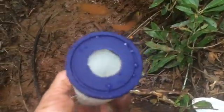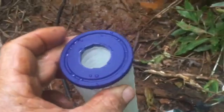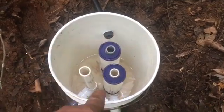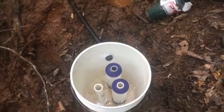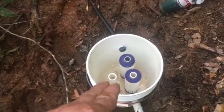Here's my filter setup. They come out with a one-inch, go to one-inch to three-quarter, and then this is just a three-quarter tee and elbow if you want two of them. We drill a set of holes that are above where the filter will sit inside. You do have to take a razor knife and cut a little bit out on the bottom — they used to fit right over three-quarter inch pipe but the metric conversion changed that. These are just plain sediment filters you get at Lowe's, two for about ten bucks. Water comes in from the spring, has to fill up, go through the filters into those holes, and out this pipe to the tank. One pipe is overflow, and I might go ahead and pipe that overflow into the tank as well — that way if the filters get clogged it'll just go down the overflow.